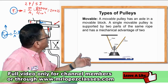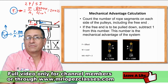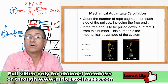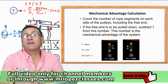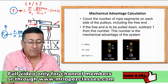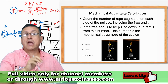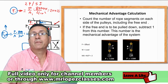The other pulley we have here is the movable pulley, which provides mechanical advantage. The simple way to calculate the mechanical advantage is to count the number of rope segments on each side of the pulleys including the free rope. If the free rope end is going down, don't count it. If the free end is going up, you add it. For example, in the first picture you have one, two, and three segments, but the free end is going down, so the mechanical advantage is two. In the second one, you have three lines and the free end is going up, so the mechanical advantage is three.